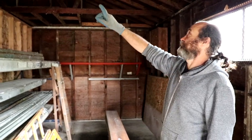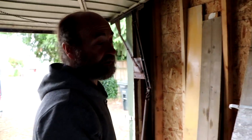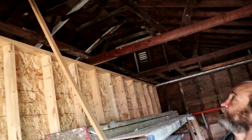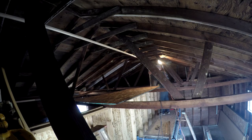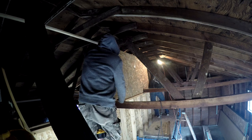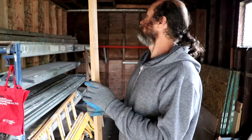So the first thing we need, because this is a half garage, half duplex. Our intention today is to build a block, this area here. From this wall to the center somewhere, we're just going to put a few strips of wood in here, another one up, and screw on a sheet of plywood. That way it might be used for storage or something, and our material doesn't fall on the other side to the neighbor. And we build our shelves, that way we have it more organized.